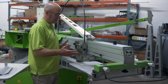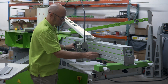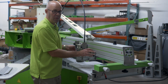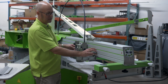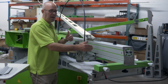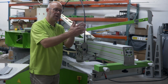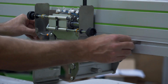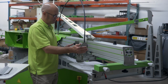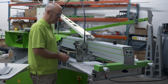This problem often arises when people are trying to do a left chest print and want a very small print stroke, so they move the limit bars close to make the machine run faster. We do want them close and we do want to run fast, but you need at least enough separation that you're not blocking both sensors. Additionally, with an appropriate gap you'll have a stroke that allows both the flood bar and squeegee to cover the image. If the bars are too close, you wouldn't get full flood bar and squeegee coverage over the image anyway.